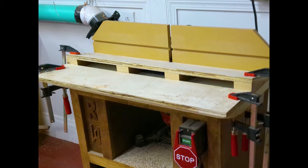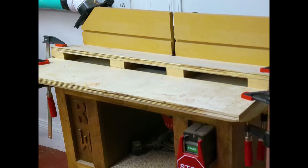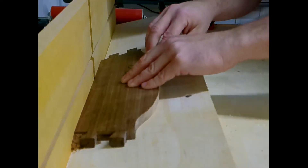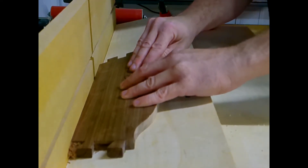I'm using a quarter-inch bit to cut a groove in the bottom of my tray sides to hold the bottom. I have to cut this at the same angle as the sides, and this jig in conjunction with my router table makes that a fairly easy task. I put the groove in all four sides.